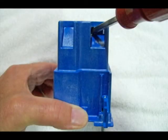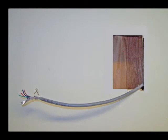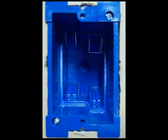There are tabs at the rear of the box for the wires to go through — just open those up slightly, one or two, whatever you need. This opening ready for a box is shown in my basement. This is what I'll call the end of the run — the last box I'm installing. Always make sure you put your box on the wire coming through the box before you solder your RCA connector plate in place. If you don't, you're going to have to desolder it and do it all over again. Test fit your box in the wall, pull it out, slip your wire through one of the holes in the back of the box, and stick it back in the wall.